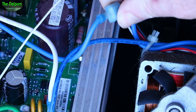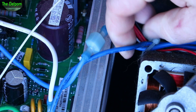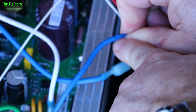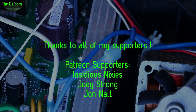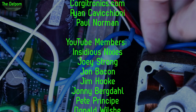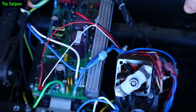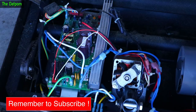Looking at these main AC wires — there's a blue wire marked as AC hot, and it's rubbing on the edge of this heat sink. There's a slight mark there, and on the back of the wire I can feel a little divot. That might be causing an insulation breakdown. You'd think with all the vibration from the motor and people bouncing on a treadmill, having wires running across the heat sink like that isn't a good design. There's another wire over here with a little black mark as well — it's been rubbing on there too. A few things I'm not liking. I need to get this board out to see what's underneath.